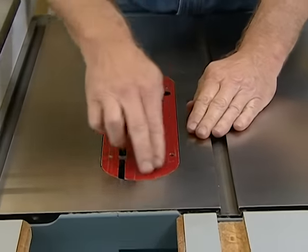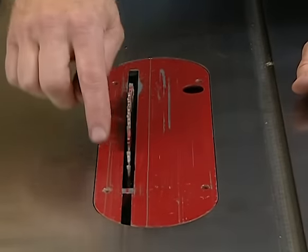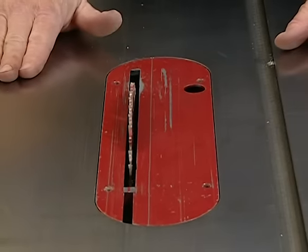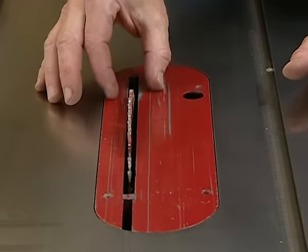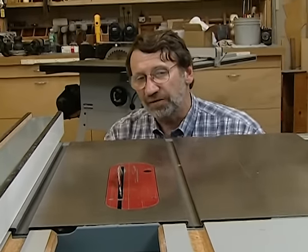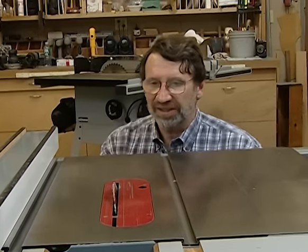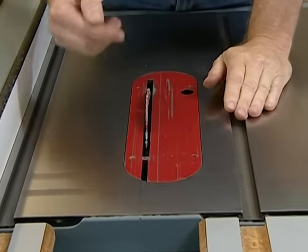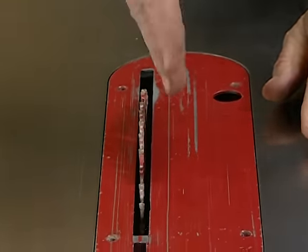Let's talk about inserts — that's the red piece here in the middle of the table. This is the one that came with the saw; it has four leveling screws, and I can use an Allen wrench to crank it up and down until it's absolutely flat with the top of the table surface. That's very important because I don't want the wood tipping in. The slot around the blade is pretty wide, and that's deliberate because without having it that wide, I would not be able to tip the blade to 45 degrees without it binding. That's fine for bevel cuts, but there's an issue — when I rip or crosscut plywood, I can get tear out, and a little strip of wood could get sucked down beside the blade.